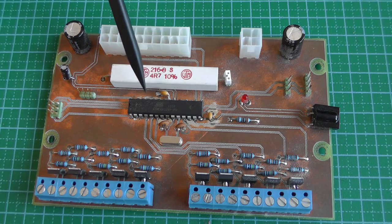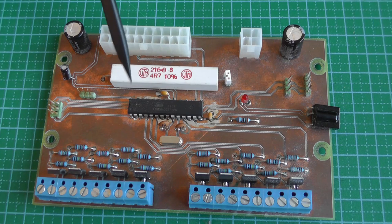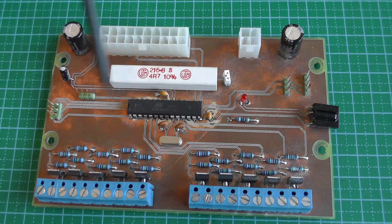The microcontroller is connected to the ATX power-on pin: pulling it low starts the ATX supply. The supply then replies with a 'power good' signal within 500ms once voltages stabilize. If power good doesn't come within one second, the microcontroller switches off the power supply as protection. On the left is a 6-pin ISP header for programming the microcontroller. There are also smoothing capacitors for the 5V rail and two small capacitors for the crystal.